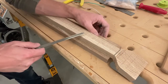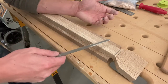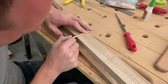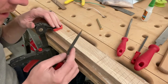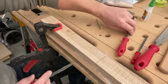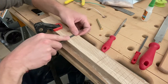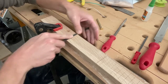With all the sanding I've done, it's actually gotten rid of some of my grooves, so I need to go deeper in some areas and clean those up. I need to get this hinge pin to set in here, which means I need to do a lot more filing. I've been using this little half-round file, which I've been really liking, but you can't start with it because it has a tendency to move. Use the triangular ones and the rectangular ones first, then once you get to this point you can really start to get a good groove made for that hinge pin to rest in.